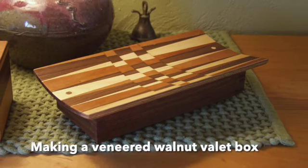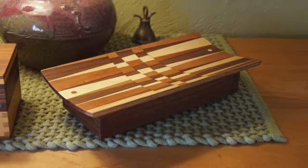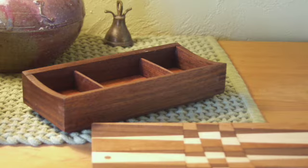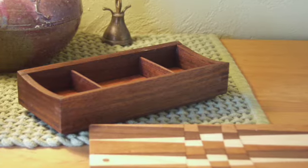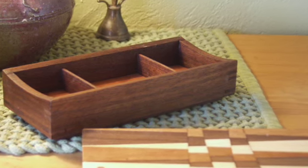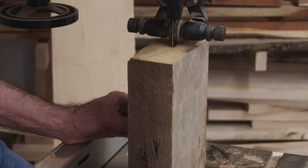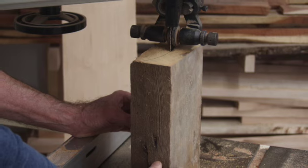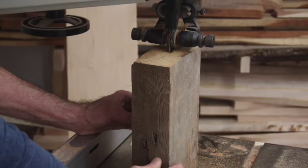This is a project that I did for Woodcraft magazine, January 2006. Illustrating a vacuum lamination technique, I first made a mold and then used several layers of veneer to form the curved top. I made the mold by making a concave cut into a piece of scrap lumber.